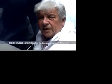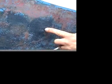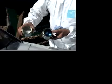After blasting off the antifouling, you may find this has happened. And this is where the gel coat, if it's old, has become rather brittle, and it will break out slightly, leaving little pop marks. These need to be filled. For that you require a watertight filler, which is a two-component solventless epoxy filler. It comes in two colours.